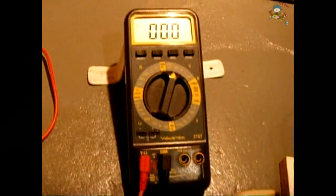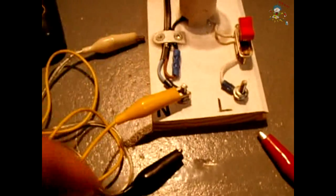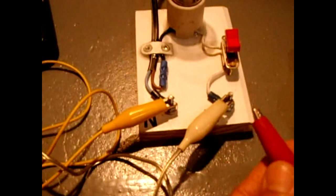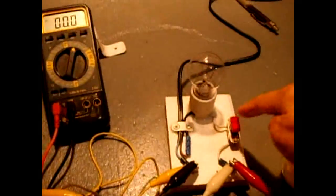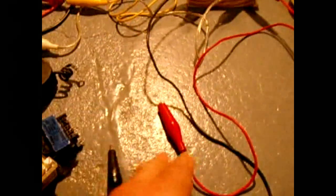The first thing I'm going to do: the circuit is powered up. I'm going to take my digital multimeter on AC volts and connect it across the testing position. Alright, so we've got one probe there and one there — this will be the hot wire heading to the load from the filament in the test lamp, and this other black wire goes to the neutral. It's just a simple circuit. When I push this button the light activates — that's just the momentary switch to test the circuit.